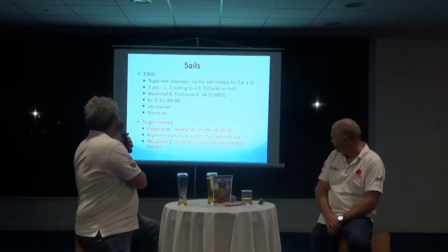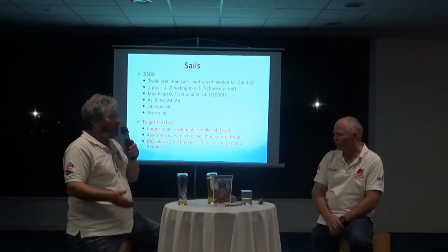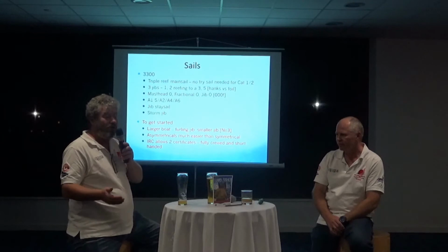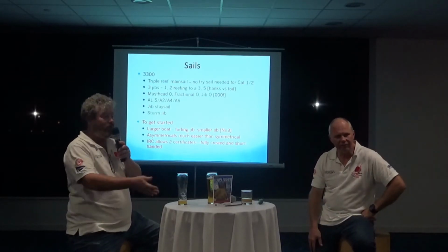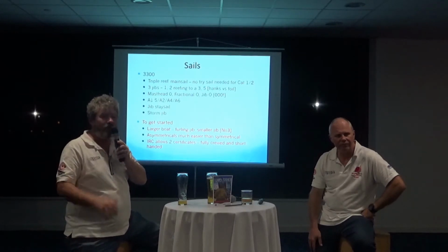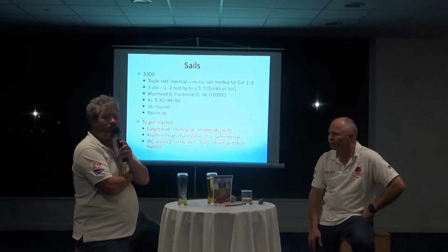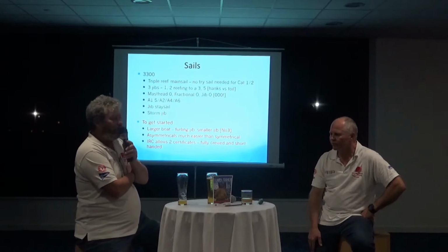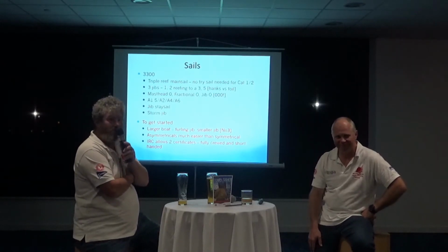Other than that, we run the triple reef IRC main. Nowadays, you don't need a trysail. As long as you reef and you talk to your sailmaker, pretty much every sailmaker is all over it. As long as your third reef is in the right position and organised, you do not need a trysail anymore. We finally worked out that it's more dangerous plugging it in than it is putting the third reef in.